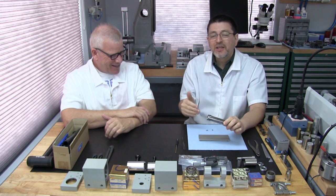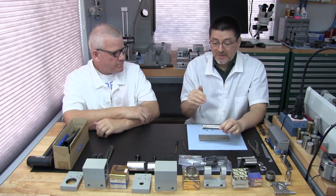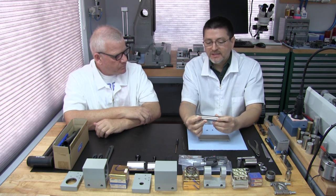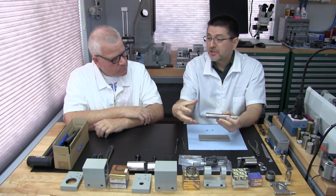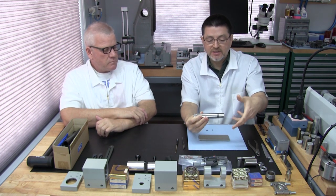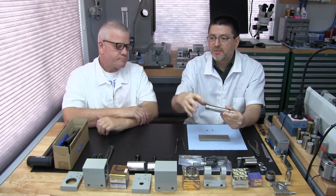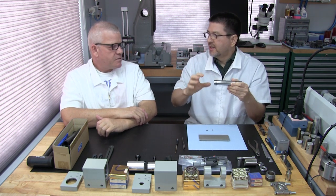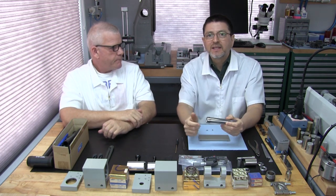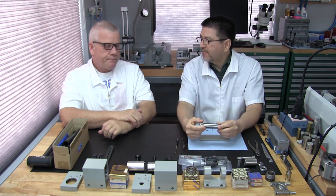Yeah, and what usually causes that, especially with the smaller WW collet spindles, is that a user will put in a 3 or 4 jaw chuck, a larger chuck, and they don't tighten the drawbar hard enough. The chuck's really loose, and just because of the weight and momentum of the chuck, the force shears the key right off. That's why you'll see a lot of used lathes with the key missing or sheared off.